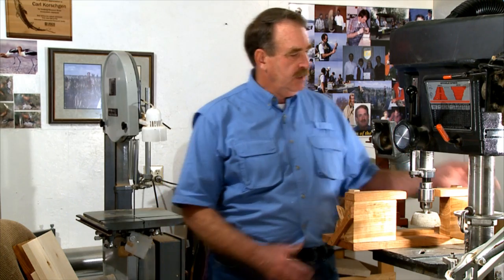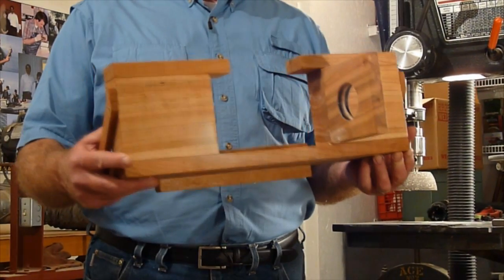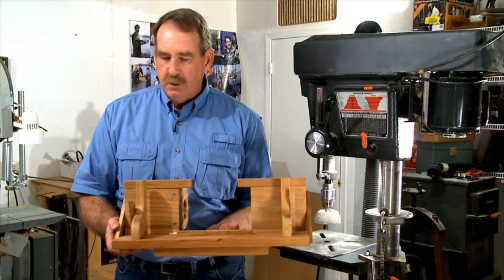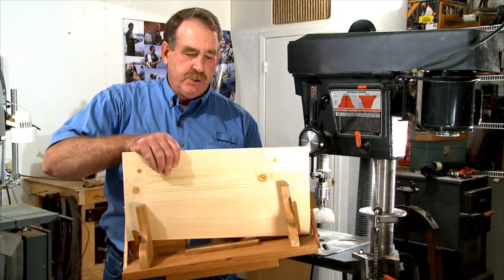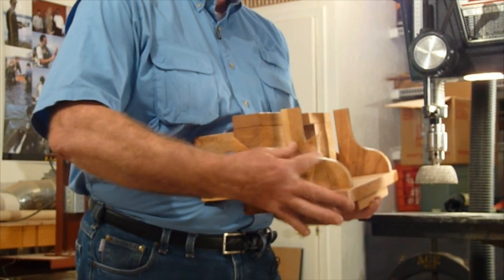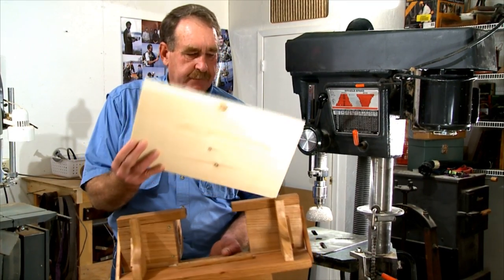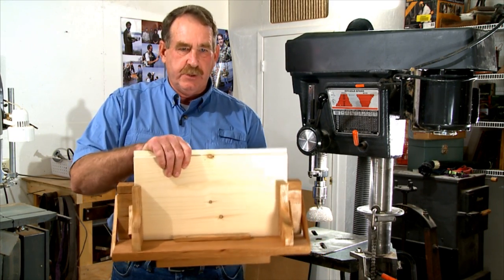This is the wooden jig that I developed. It is basically a bunch of support pieces on a base, and I will show you individually how all of this comes together. You simply drop a hive board into the jig, and the jig automatically centers the board. By flipping these levers, you can insert the narrow board for a hive body, and it is perfectly centered into the jig.